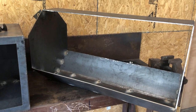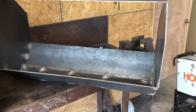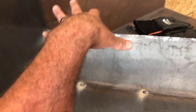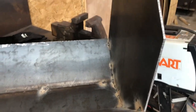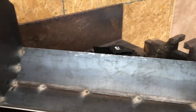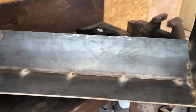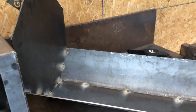You don't have a big difference in your hot spots. Typically, when you cook where the heat just comes out on this end, if the firebox was over here, you had your heat come out, it would be hot on this end and cool on this end. You might have about a 15, 20 degree difference in here, but then you go with those tuning plates. If it's too hot down here, you just slide them tuning plates down a little bit, let a little heat come up through the middle. Eventually you'll figure out what works best.